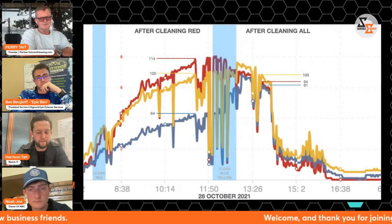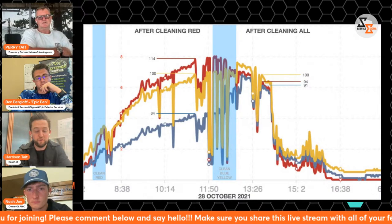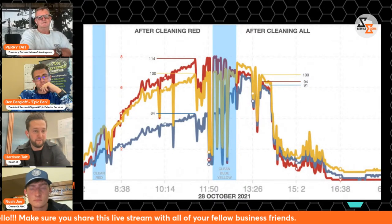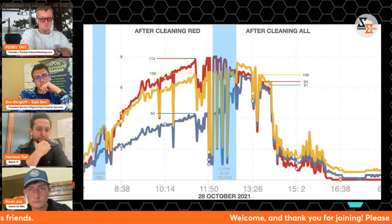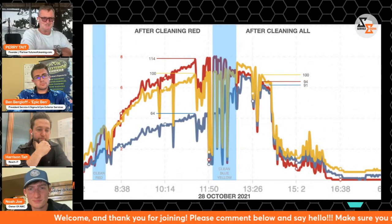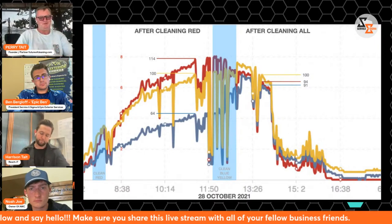I think what also matters is what's the least level of dirty the panel needs to be for a guy like Chris to be able to talk to the customer and say, this is dirty enough to be affecting your solar gain? Yeah, and that's when I think if you can see the surface of the panel, because the surface of the panel is meant to be glass and you're not meant to see glass. Glass is transparent. So if you can see the surface of the panel, you're seeing dirt. That dirt is reflecting your solar energy that you want to go through the glass into the solar panel.